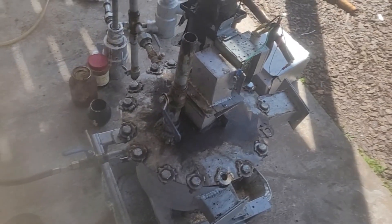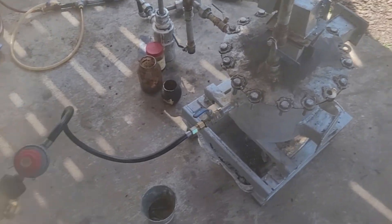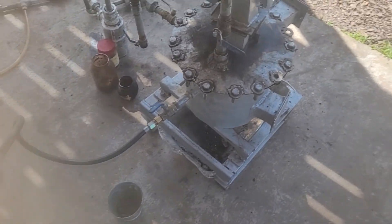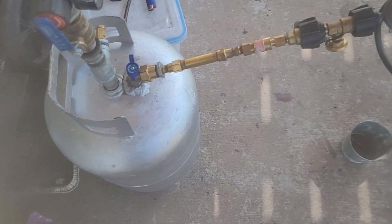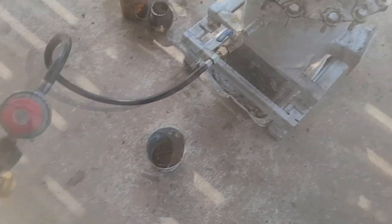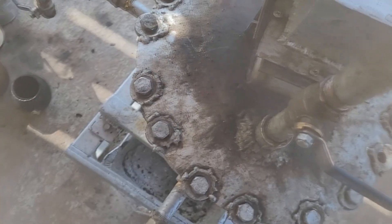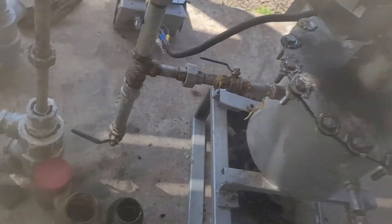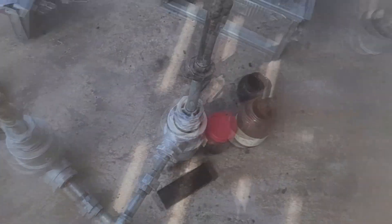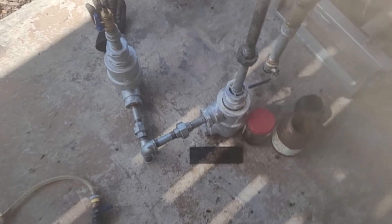With the lid on, the last step is to flush out any oxygen. Pyrolysis, unlike incineration, involves no oxygen — meaning no combustion, no flame, no dioxins. Here I have a compressed tank of syngas from previous reactions, which will make this an inert atmosphere. I pump this in, turn it on, hear it flowing through, and I know it's working because I come over to the output here — the gas goes through the filtering system and comes out here, and I should be able to light this on fire. And, yep, there we go. Now we know the gas is coming through, oxygen is being pushed out.